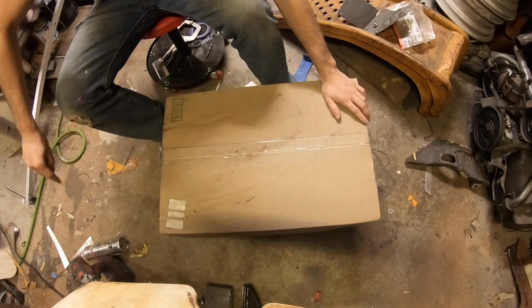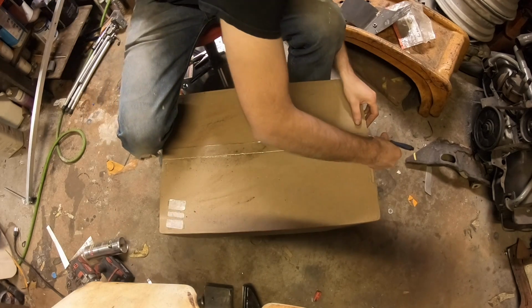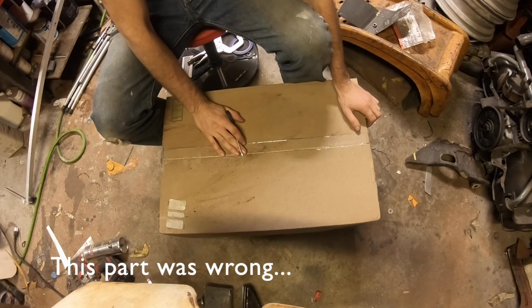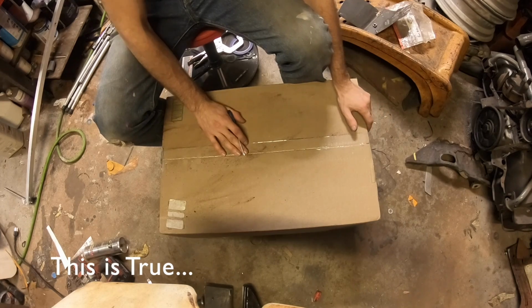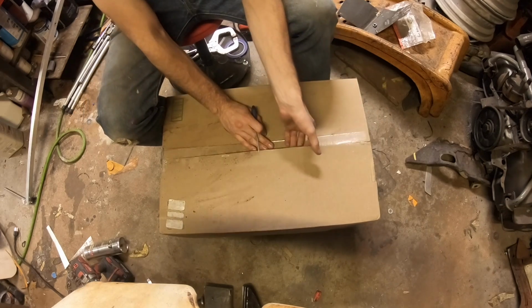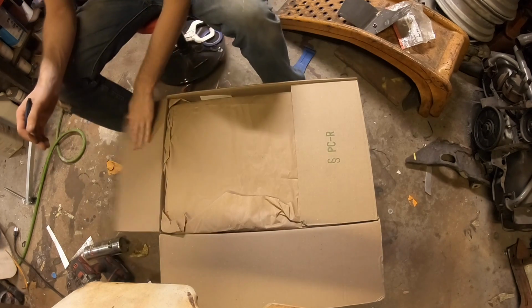So, from my understanding, TIG welding on a car, on sheet metal, is pretty nice because the welds don't get as hot as a MIG, so you don't run as much risk of warpage, and since you're not adding a ton of filler wire, they're pretty flat and they're easy to grind down. But we'll find out when we try to use it, because I'm no expert TIG welder.